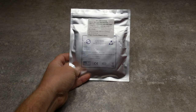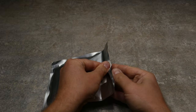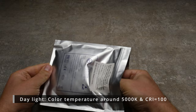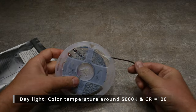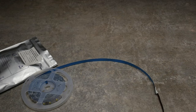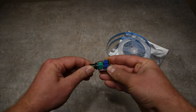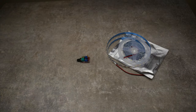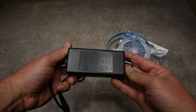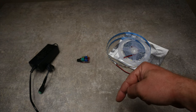CRI, or Color Rendering Index, is a way to measure the ability of artificial light sources to reveal colors as you would see them under natural light. An artificial light source with a light temperature close to that of daylight and a reasonably high CRI should provide an adequate spectrum for growing plants. To find out more on building efficient DIY grow lights, check out the great video made by Shane from iGro — link in the description. Along with the LED light strip, I also ordered a PWM controller which acts as a light dimmer and on/off switch, as well as a 12V power supply.